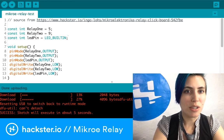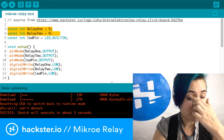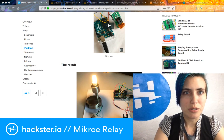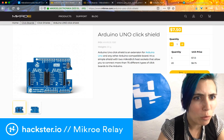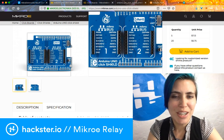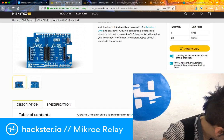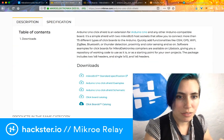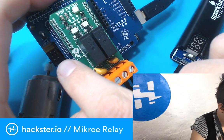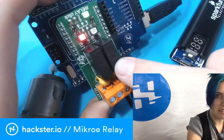Here in Arduino I've extended that to show both of these relay pins, which I determined by looking at the information — they're also labeled, but it's a little opaque what these things actually stand for. CS/D9 and D5/PWM are the two that I'm using. On the relay board itself, I think they're labeled RL2 and RL1, and those happen to correspond to pin 5 and pin 9. You can see when they turn on, not only when you hear them, but also by these indicator LEDs, which are pretty sweet.